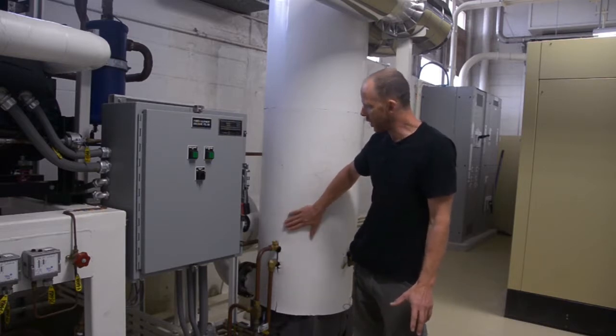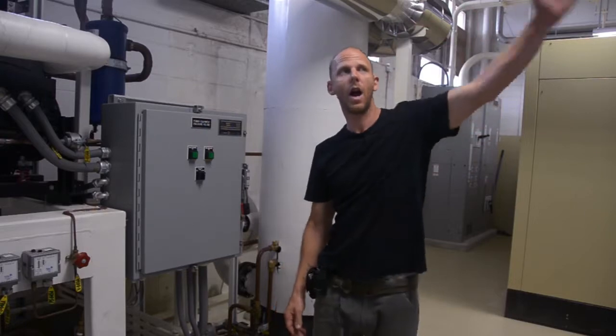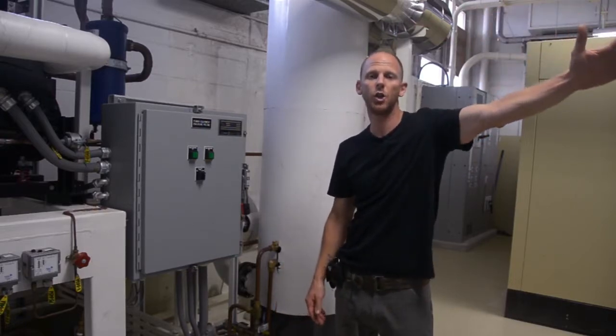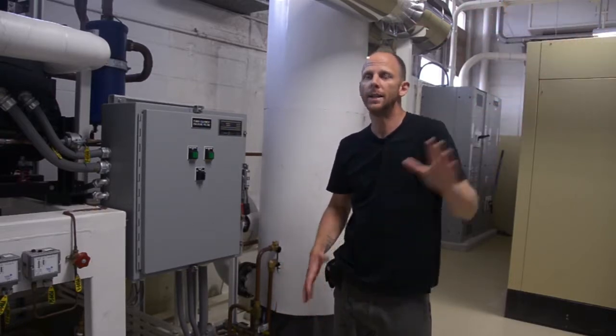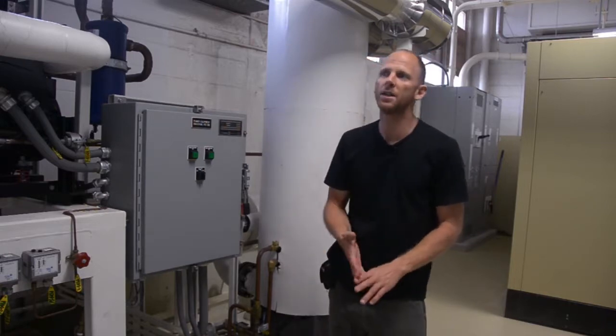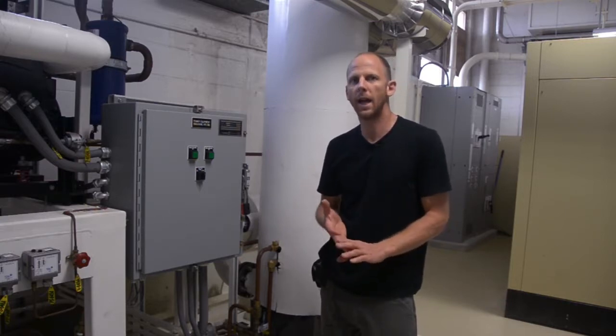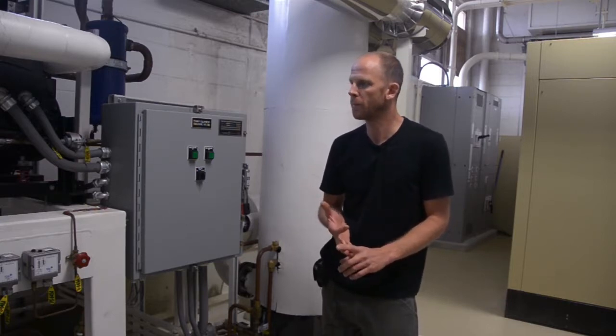So our air stream that comes out of our coalescer is now ready to be sent to our purification unit on our ASU. It's had most of the moisture knocked out of it, and by the time it comes through the coalescer, we're probably looking at air that's about 7 or 8 degrees Celsius, ideally, ready for purification.